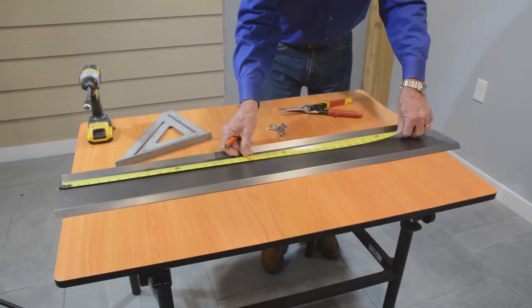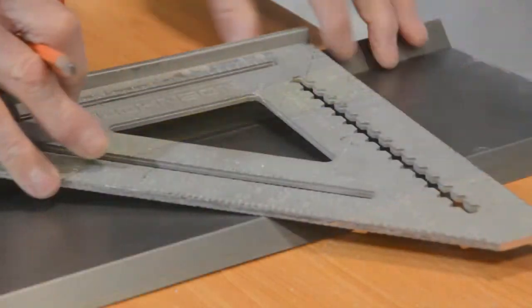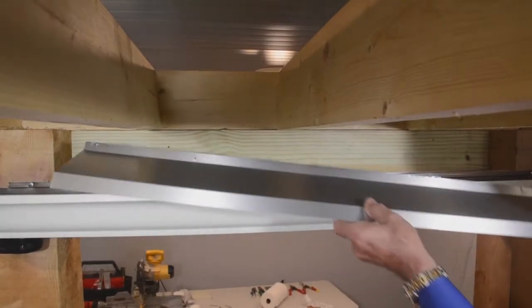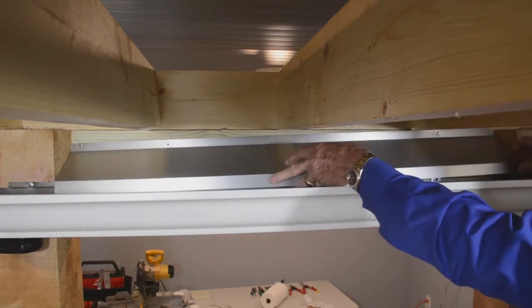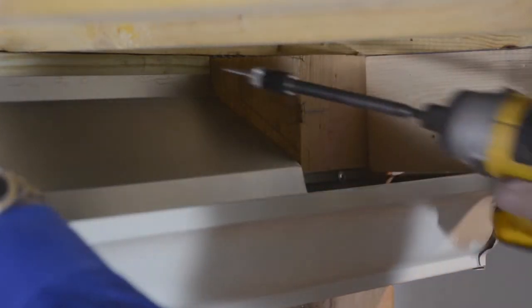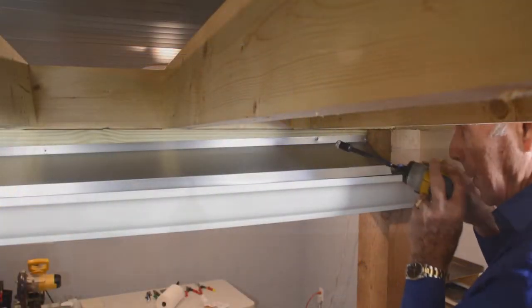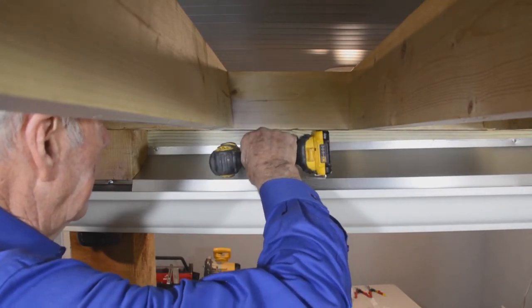The gutter flashing is trimmed to fit between each set of support posts. Its purpose is to direct water from above into the gutter and to prevent water from reaching the U-channel just installed. Fit the flashing so that the top edge fits against the trim board just installed and the bottom edge hangs over the back of the gutter. It is manufactured to fit the size of your support posts.